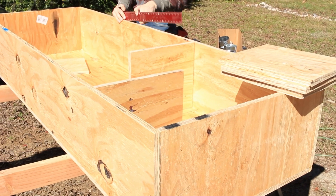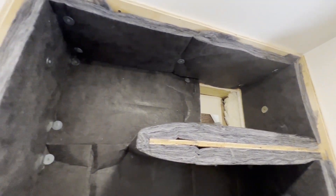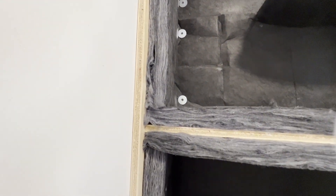The AC Infinity fans typically use a four-inch duct, so we can use a four-inch duct hole on the outside of the vocal booth wall. But on the inside we can't use just a four-inch hole because the airspeed would be too fast, making audible air noise in the vocal booth. So with our baffle boxes, we need to create a system that makes the duct size bigger than four inches and has insulation inside so that fan noise and outside room noise traveling through the duct gets absorbed before entering the vocal booth.